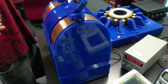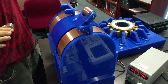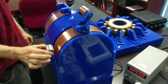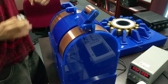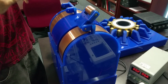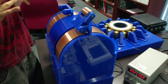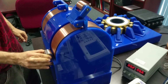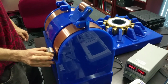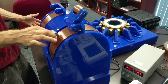But instead of it going through a copper tube, what happens if you rotate the tube and you have a magnet on the outside? Same thing, you get the repulsion effect. Also, if you have a copper rod and you have a magnet ring around it, spin the copper rod, the magnet ring will stabilize around it, like a shaft without a bearing. It just becomes a frictionless bearing. So that's just to show, okay, there's a repulsion factor, but it's not spinning.